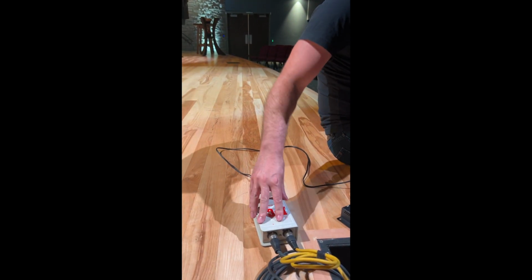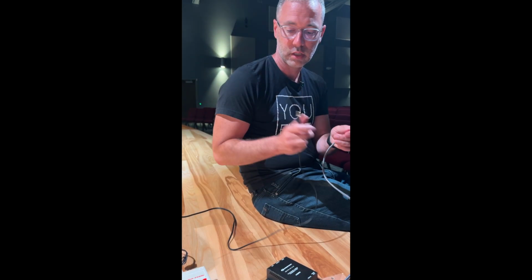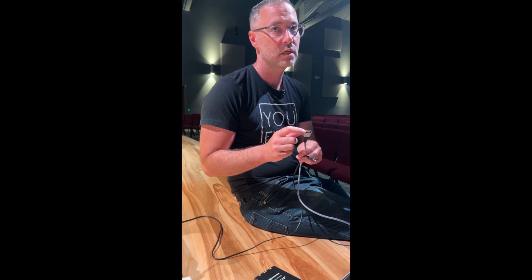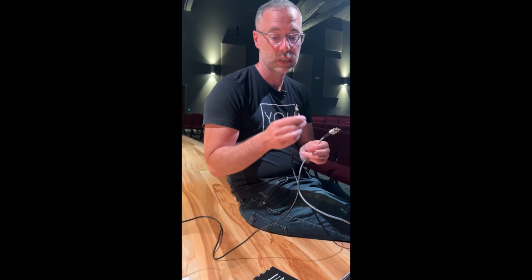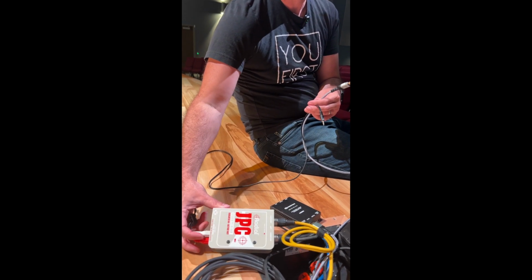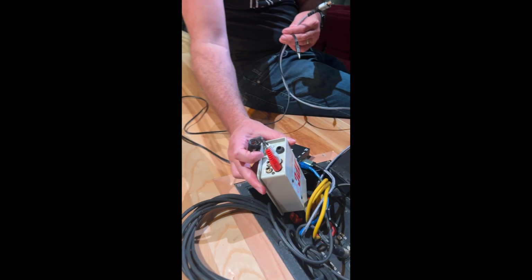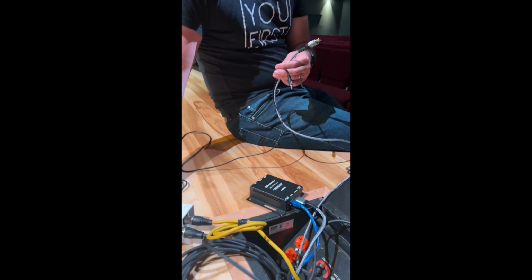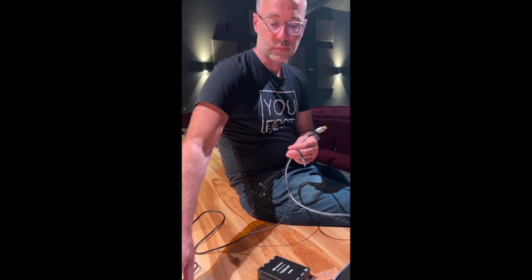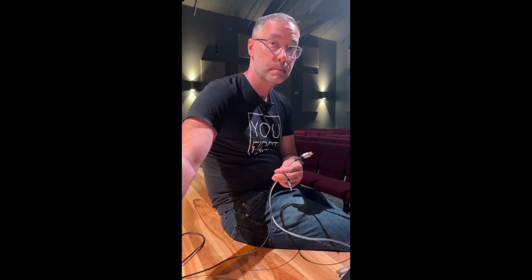This is an audio, just a lot of times, no, actually, I think we need this with how our system is set up. We don't have audio over HDMI with how our configuration is, so we need this guy. This is a little stereo DI box specifically for like these little RCA. You can plug other stuff into it as well. This does need to be phantom powered to work. So that's one thing. This runs to the audio mixer. So this you cannot use on Quick Mix.